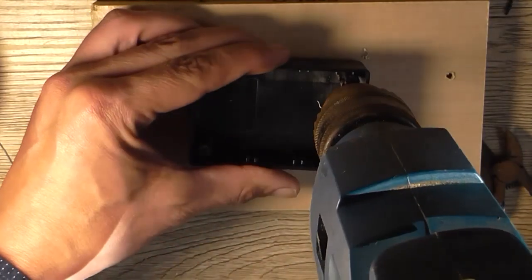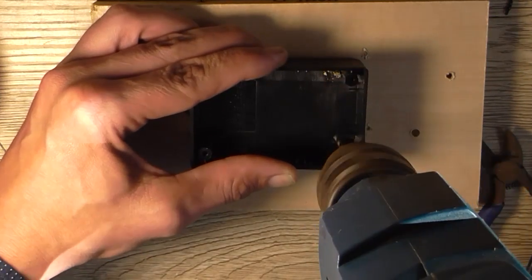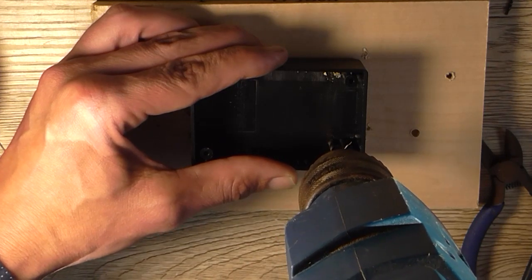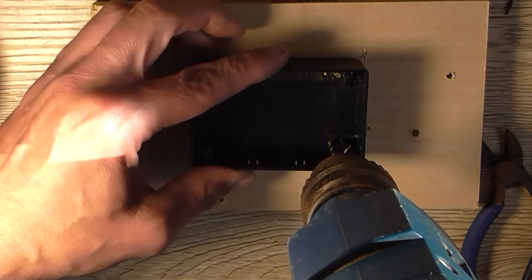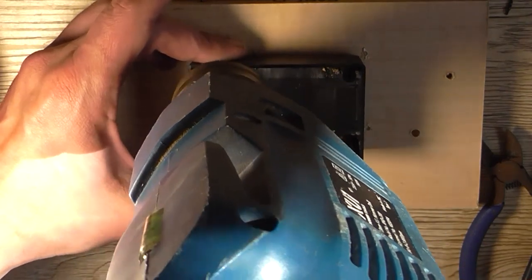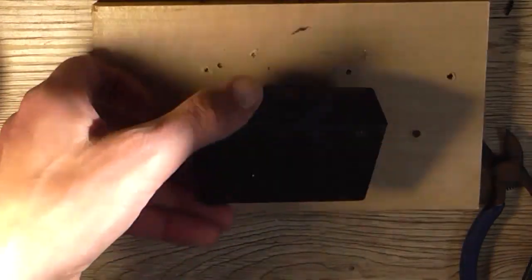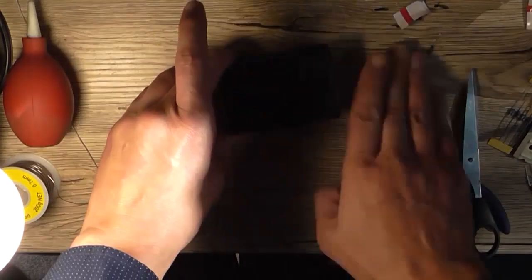Now I'm glad I stopped myself before soldering in the rest of those resistors when I noticed there was a problem mounting the LEDs, and I did read the instructions and it says the 4 resistors under the LEDs will make it impossible to install the LEDs, so don't install them. It's exactly what the text in construction details said. As I say, it pays to read the instructions, because I was getting a little bit confused. But that's all the drilling that we should need to do for now.